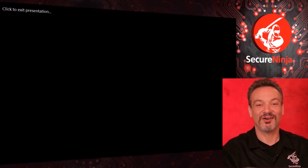Awesome. All right, Alicia, any questions? Now, Larry, you mentioned antennas. What kind of antennas are used for war driving? Well, it depends. Typically when you start, you want an omnidirectional antenna, so it's going to pick things up in a wider range. But if you're trying to focus on an area, and once you know, hey, there's something a lot in that apartment building, from here let me get a more directional antenna, and you can get a Yagi antenna, like I said, people have done it with a Pringles can, that shrinks it down to about 30 degrees, so really focusing and getting you a lot more range.